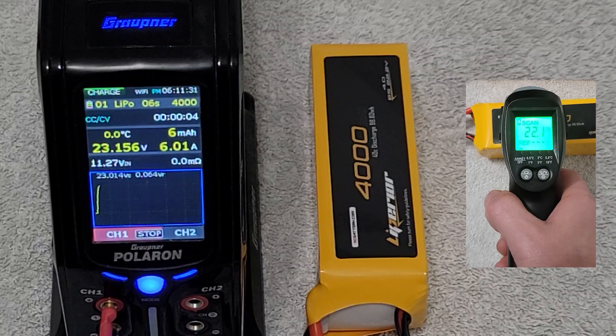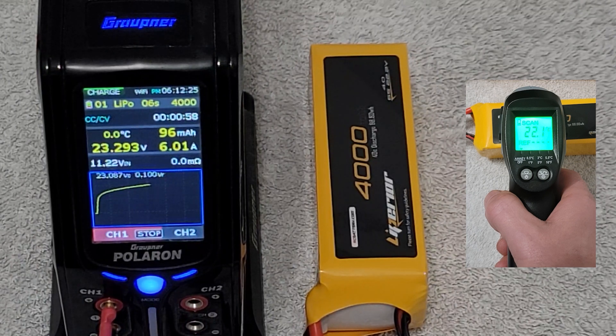The very first item on our list is ambient temperature. Ambient temperature is definitely a contributor to fluctuation within internal resistance measurements while you're charging your batteries. If you're charging outside, you're subjecting them to significant differences from day to day or even hour to hour. What is ideal is to keep the temperature within a degree or so — plus or minus half a degree — of a selected temperature. If that's not practical, just keep it within the tightest margin you possibly can with your setup.